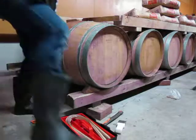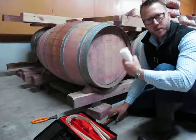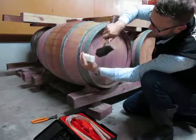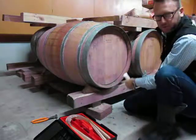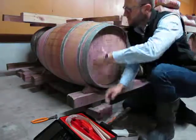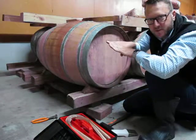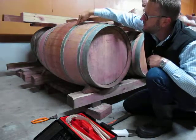There will also be a nail on the other side, so assuming we've removed that, just pick up your Cooper's tool and give it a knock, working your way around the barrel — all the way around back to the top. You might have to do this two, three, or four times. Just do it evenly on all sides, and what that'll do is tighten up the oak. If you've got any leaks along here, that will just push those staves together and tighten up the leak.